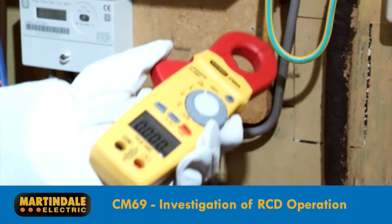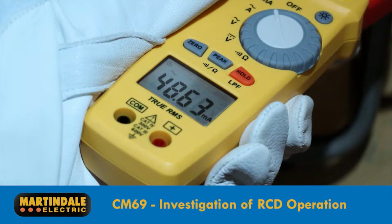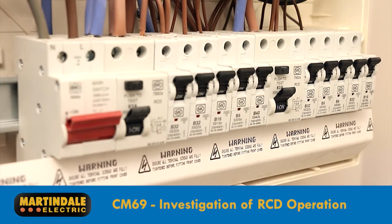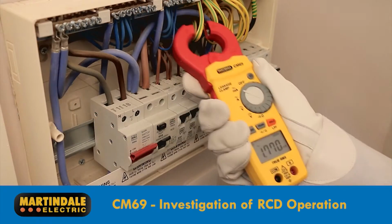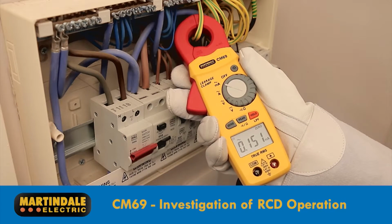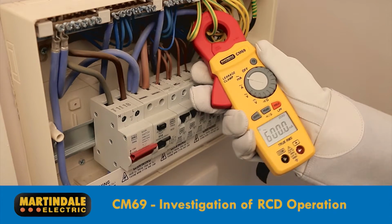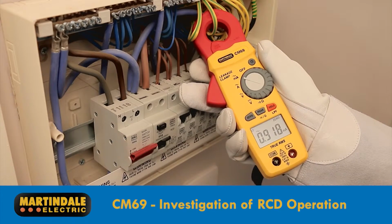We can check the level of protective conductor currents by placing the CM69 around protective conductors. Here, the earthing conductor gives a reading for the whole installation. As you can see, it's quite high. This is a split load board, so obviously this figure is shared not necessarily equally across the RCDs as well. We can also take readings from individual CPCs to perhaps highlight the circuit where an appliance may be causing a problem. And there's a useful peak function to record the highest leakage currents when powering up remote appliances and equipment.